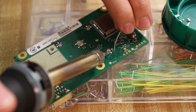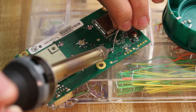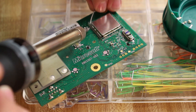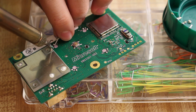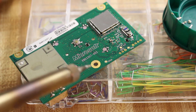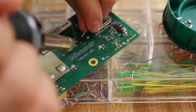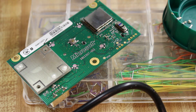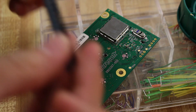Now after I pull off the LEDs, what I always like to do is go in and just touch up the solder. As you can see, I go to each soldering pad - all the positives and negatives where LEDs used to be - and I just put on a fresh dab of solder on each one. What that does is it gives you new solder to work with, which should be easier, but it also kind of elevates the LEDs and puts them on a platform. It puts on fresh new solder so that allows you to have some ease when doing this mod. If you want to make this mod easier for yourself, I highly recommend doing this.